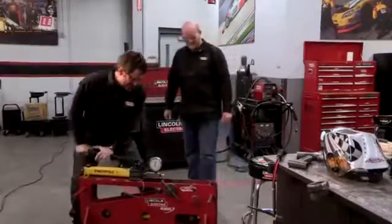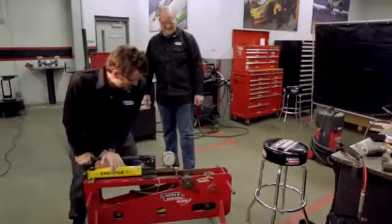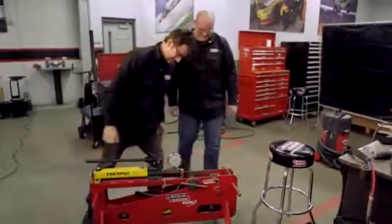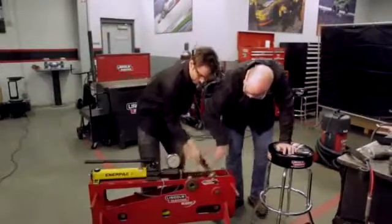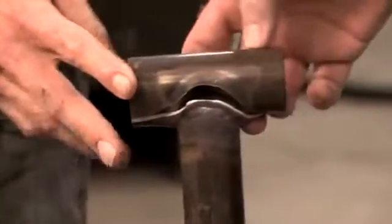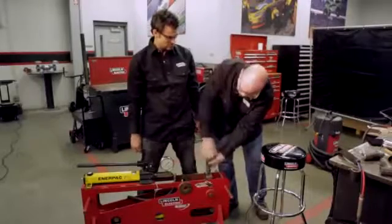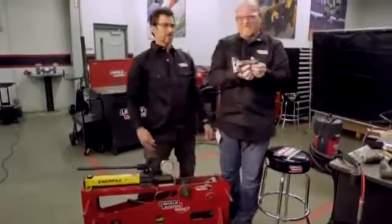We're almost at six thousand. It'll go up to about seven. Almost seven — still at 7,000, it's stretching. Oh yeah, you can see it totally pulling. Let's pop it. Oh yeah, that was a good one. And look at that — right next to the weld, right where it should be. 8,000 pounds. So that's a lot of beef. I think that would hold, don't you? Well, I'm not sure what you want it to hold, but it's going to hold 8,000 pounds anyway.